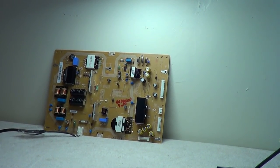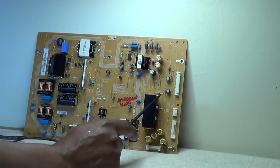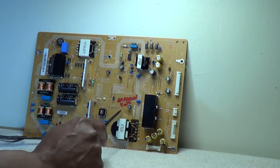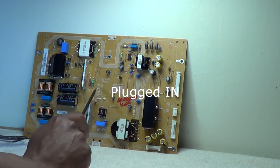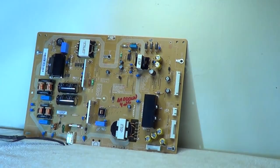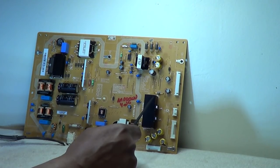As you can see, I did pull the board. This is the primary side here and this is the secondary side — or the cold side, as it's marked: secondary, primary, hot, cold. Don't touch anything over here, especially if you just have the board and you're plugging it in. While it's on, do not put your hands all over this. Do not grab the board from the bottom, otherwise you can get a very serious shock. Even after the board is unplugged, do not put your hands across these caps because you will get a shock.